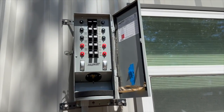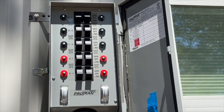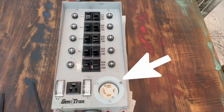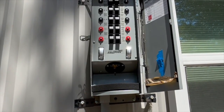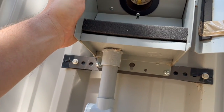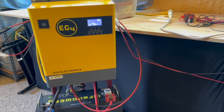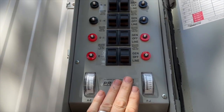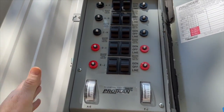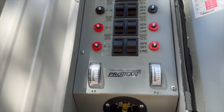This is just like the other transfer switch — it's just an outdoor model that's a little bit different. You can use an indoor transfer switch with an outdoor receptacle, or you can get an outdoor transfer switch if all your inputs are going to be coming from outdoors. If you're using a solar generator, you're probably going to want an indoor receptacle, so just get a transfer switch that has that built in. You can mount your transfer switch next to the breaker panel in your home or in your garage, and then just plug your solar generator into that.